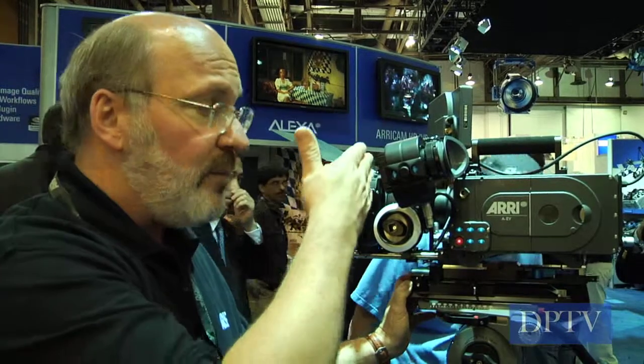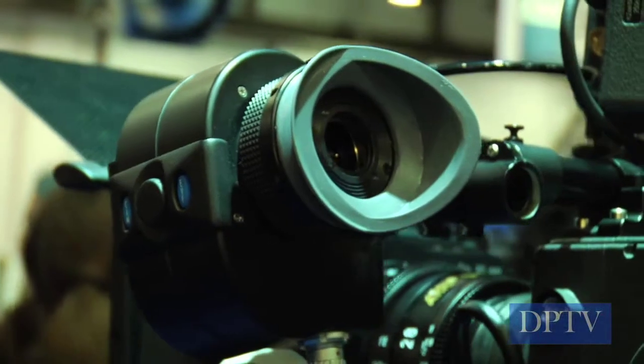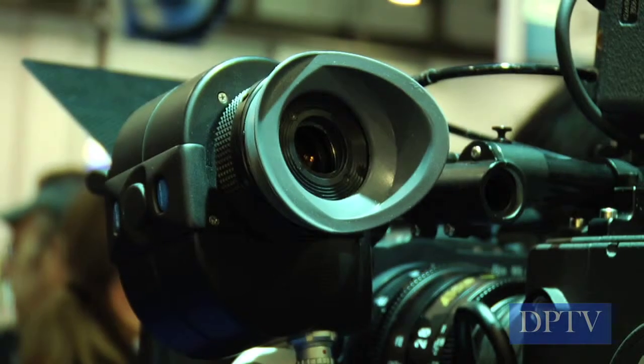It uses an F-LCOS display at 1280 by 768, which we found gave better contrast than 1920 by 1080 and still has a sharpness with that close to your eye equivalent to 1920 by 1080, and we use LED backlighting to make sure that the color in the viewfinder stays stable regardless of the temperature of the viewfinder.